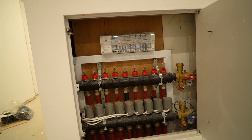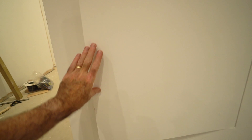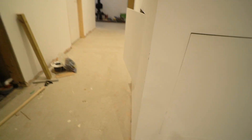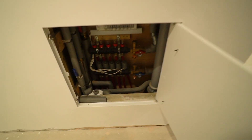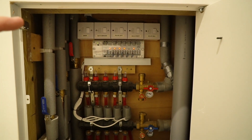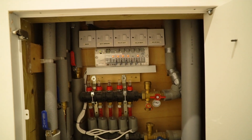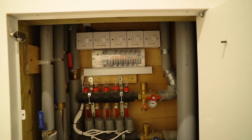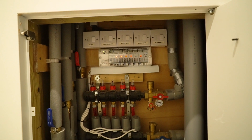The one zone not turned on is the bathroom because that room isn't finished yet, so I'm not bothering with heating in there. I'm reasonably happy with how tidy that looks — it's just a simple click-close on the panel. The second manifold is quite close by. I didn't want one enormous manifold, so there's similar wiring with a few fewer zones. I've also put in fused isolation for a number of auxiliary circuits, as I didn't want switches all over the walls.